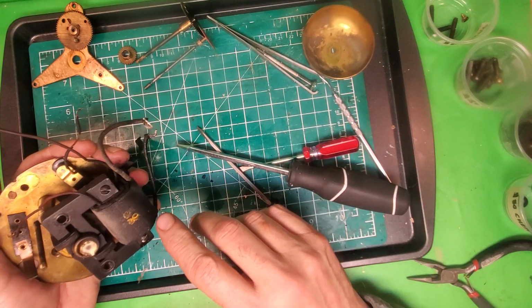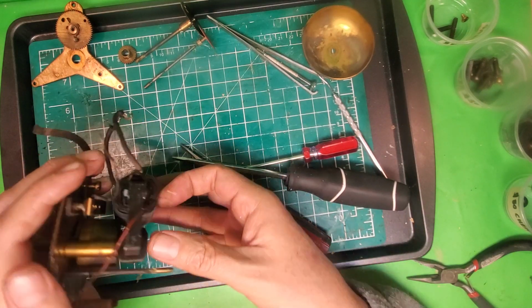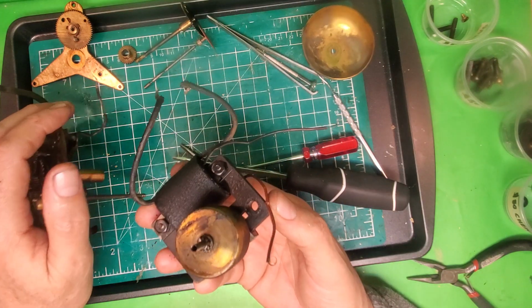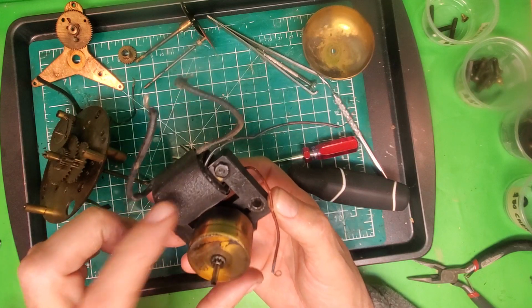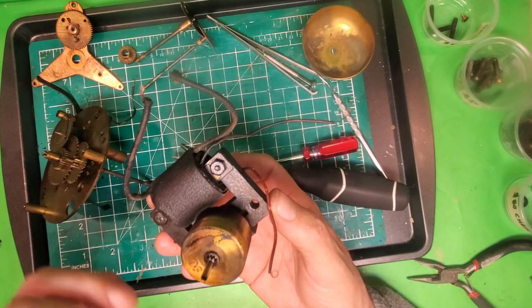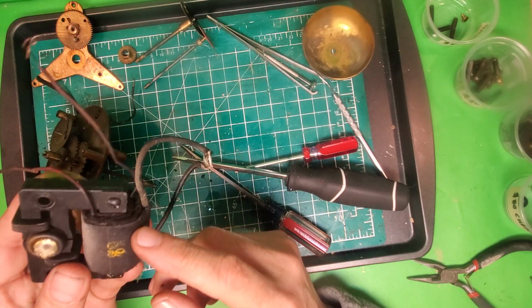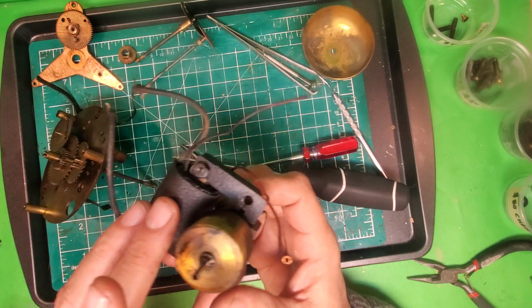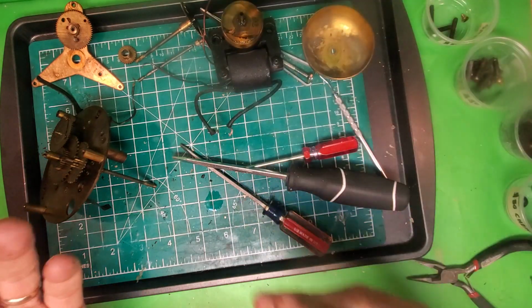I'm also going to, if you notice, this is a yellow 52, and that identifies what type of coil it is. What I always do after I wrap them and put liquid tape over it is I'll paint back on the number and use the same color. So I'll be painting a yellow 52 on here. Now we can just put this to the side right here.